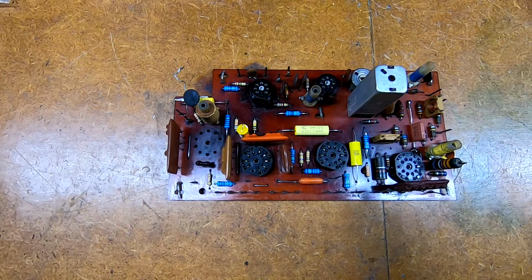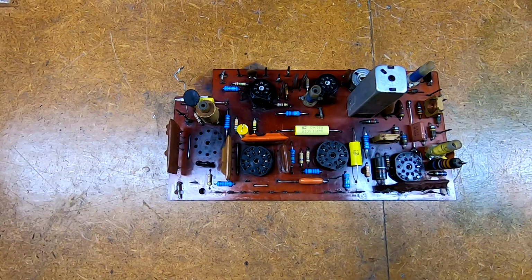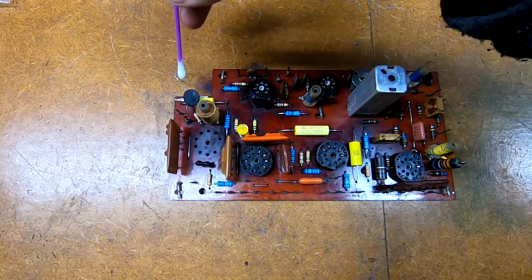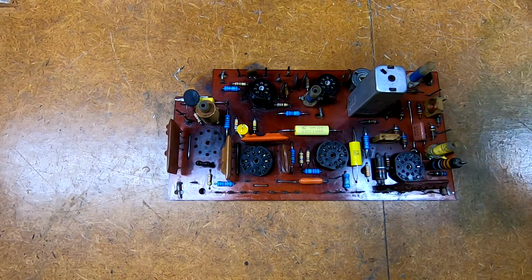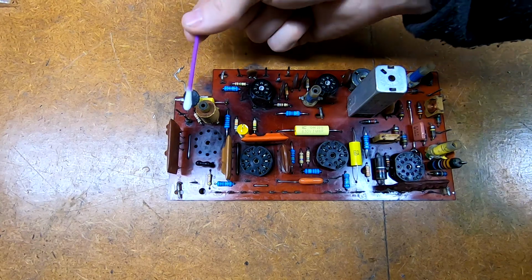So doing all of it now, putting in all new resistors, all new capacitors, couplets and tube sockets, and just getting it done once, that way I never have to worry about it. That's worth it to me. So to that end, I started on the left side of the chassis. Haven't replaced this disc cap. I'll do that later. That's more of a reference point to my drawing that I made for where all the wires go. And I've been working my way from left to right.